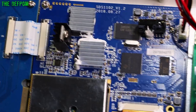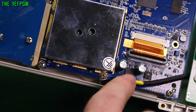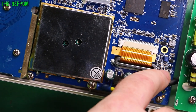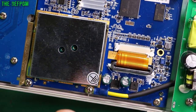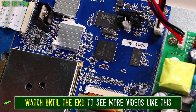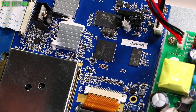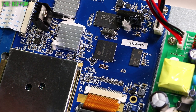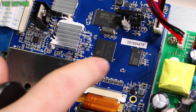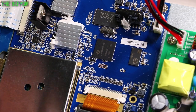It's pretty impressive actually. There are some headers here — probably programming headers and UARTs, stuff like that. Down here there's some power supply section with some MOSFETs, obviously some smoothing caps and inductors and other stuff over here, so there are probably some boost converters to generate various supplies for the rest of the circuitry. This processor is apparently an ARM Cortex-A8 by Texas Instruments — as you can see from the logo. It could actually be up to 1 GHz speed, anywhere from 600 MHz to 1 GHz. I think it's running at 1 GHz, so it's a fairly speedy little thing.